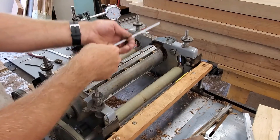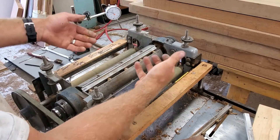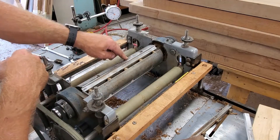The knife will be right here, and it basically sandwiches the knife on the opposite side of the pocket. As you loosen — in essence back the bolts out of the gib — it's pushing this way, expanding and pushing the knife against the front side of the cutter head.